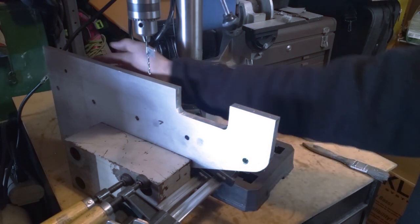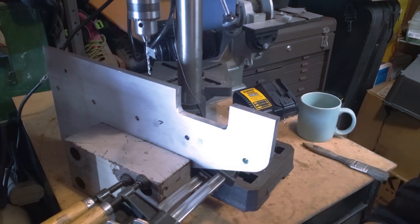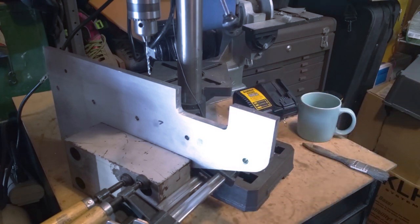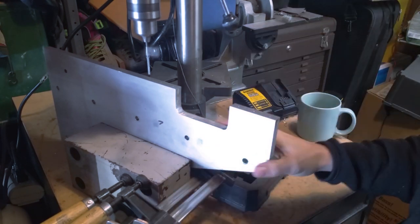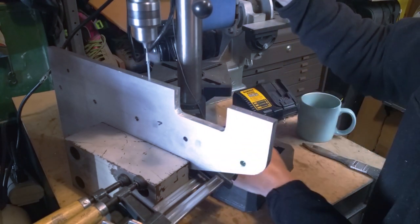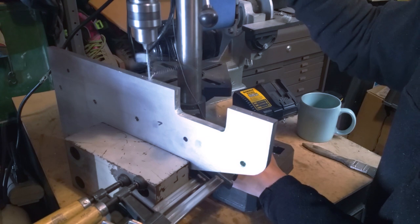I marked these locations using the optical center punch - it's not easy given it's a small surface, but it seemed to come out okay. So this would be drilled and tapped like the others. Because this plate also won't fit underneath my drill press, I can have it clamped to this block with two clamps. The only thing really holding it is friction, so I put two clamps on there and I try to get these holes straight. I want these holes to be pretty straight as best I can.